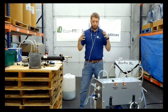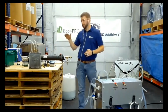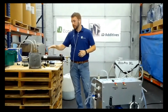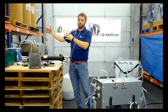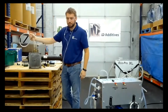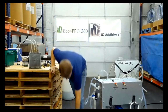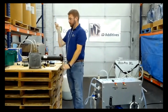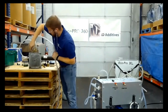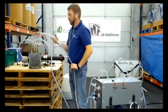So there is a little bit of upfront time in making sure that your tools are cleaned to an optimum cooling condition. But for your secondary and tertiary and future PMs, you'll be able to use jumper cables and flush all at once. So with that, we're going to hook up to a mold now. Now this is a little bit smaller mold.